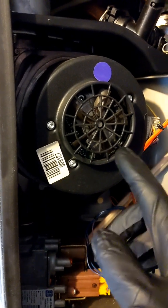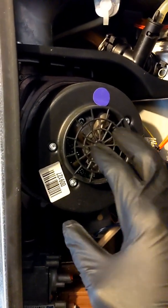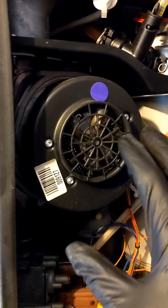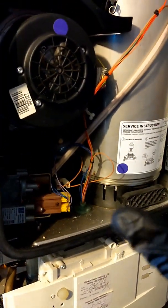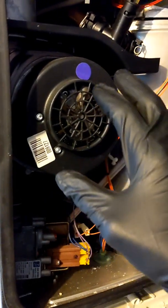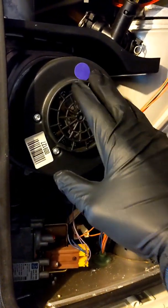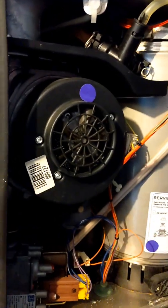The last person came here and booked up a pump, but the common issue with the Worcesters is when you turn them on you should get a small blip on the fan for like a split second — it didn't do that. I tried the hair dryer trick, but where the boiler is located — it's in like a cold outbuilding — there's probably condensation that's got onto the fan PCB and completely fried it.